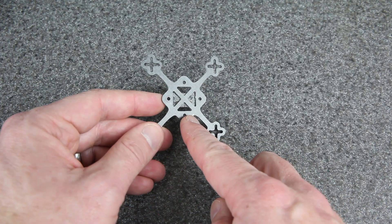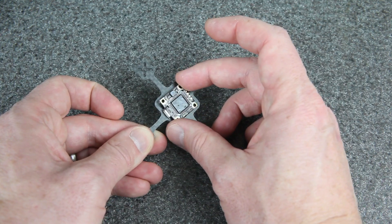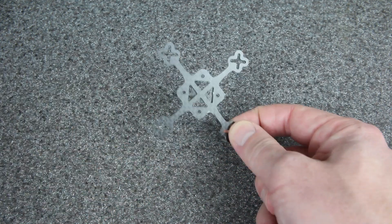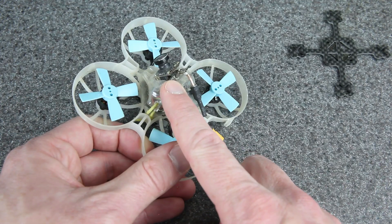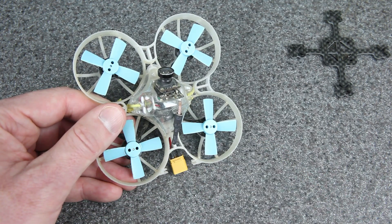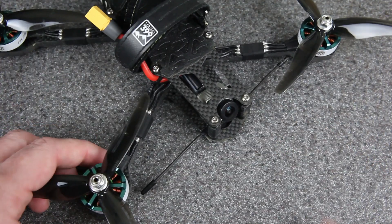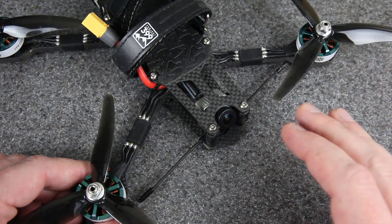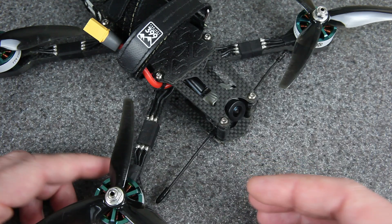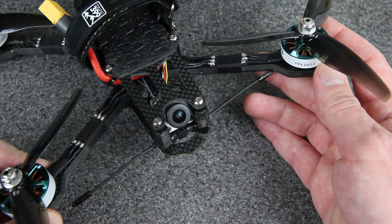Whatever works! The rotations don't even have to be multiples of 90 degrees. This cute little frame actually takes a 16 by 16 stack and it's rotated 45 degrees relative to how they normally would be mounted. This is a frame I've had for a long time — it used to be a 2S drone. I took the components off of it because those components became my first 2S whoop. There's a really old video on my channel about this. This is the build that inspired the Beta 75X — it was directly modeled on these components. And here's a five inch drone: the Super G frame from Project 399. This is easily my heaviest drone, but it flies awesome — so smooth. I recently tuned it with black box, and with low pitch props and these 25 millimeter FPV cycle motors, it's just incredibly smooth.